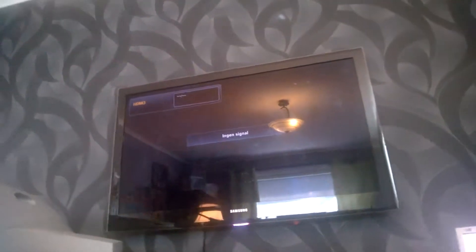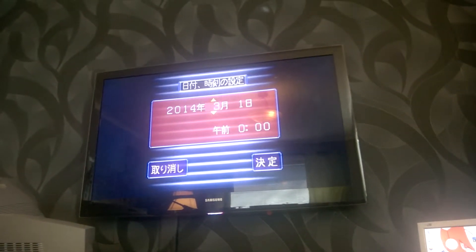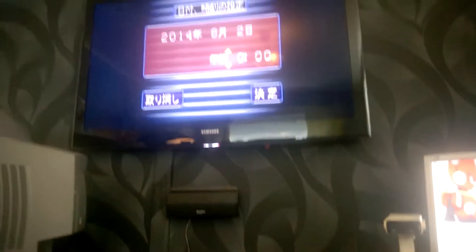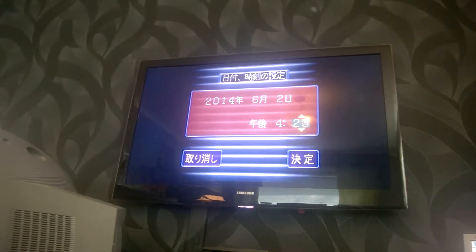We've got a brand new CR2032 lithium battery — made in Indonesia, so hopefully it's quality stuff. We're going to snap this in, pop the lid back on, push the power and boot up the Sega Saturn. Now we need to input the date again, but after this it should save the settings. The time here is 16:23, so 4:23.